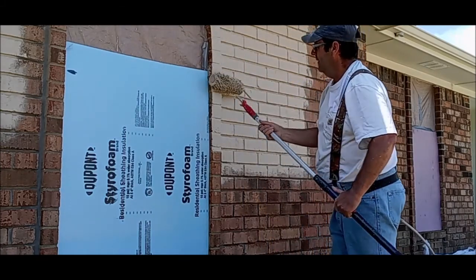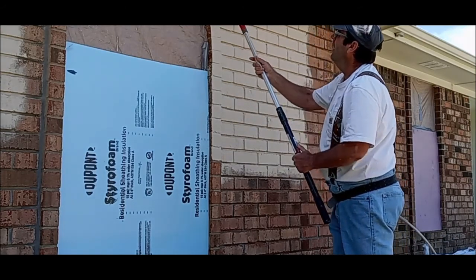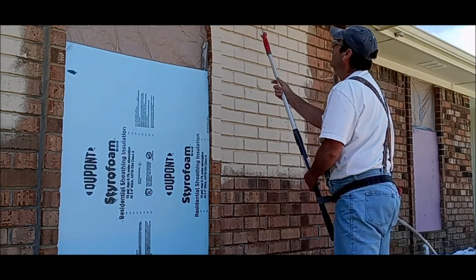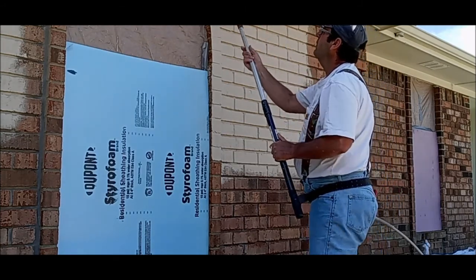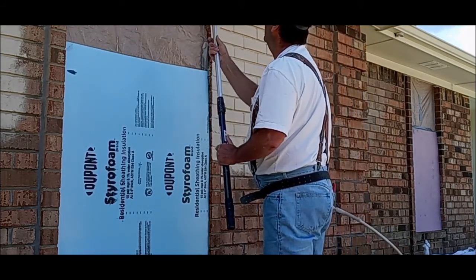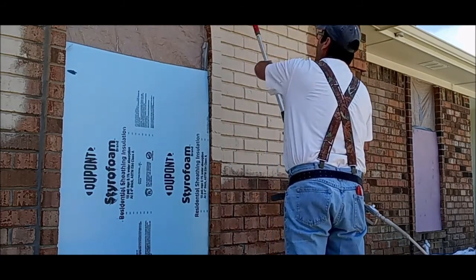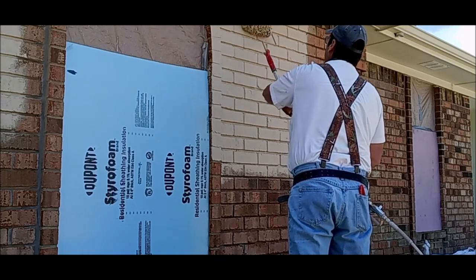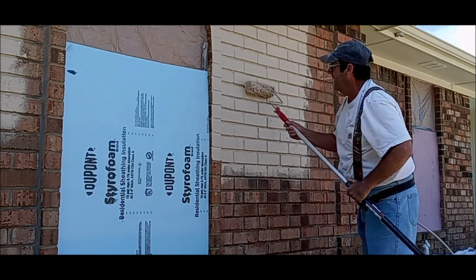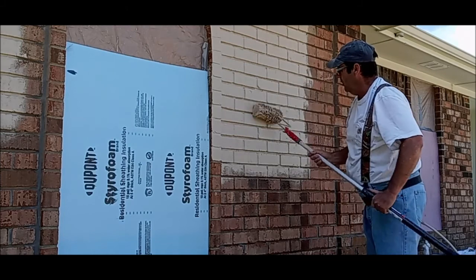I am having more success with a first thin coat as a sort of primer coat — it is really soaking into the brick well and doing a good job. It soaks in, it sticks good, and I will go with a thicker coat on my second coat. But I have to fill these mortar joints, which are very deep, and I just can't get a thick product in those mortar joints.